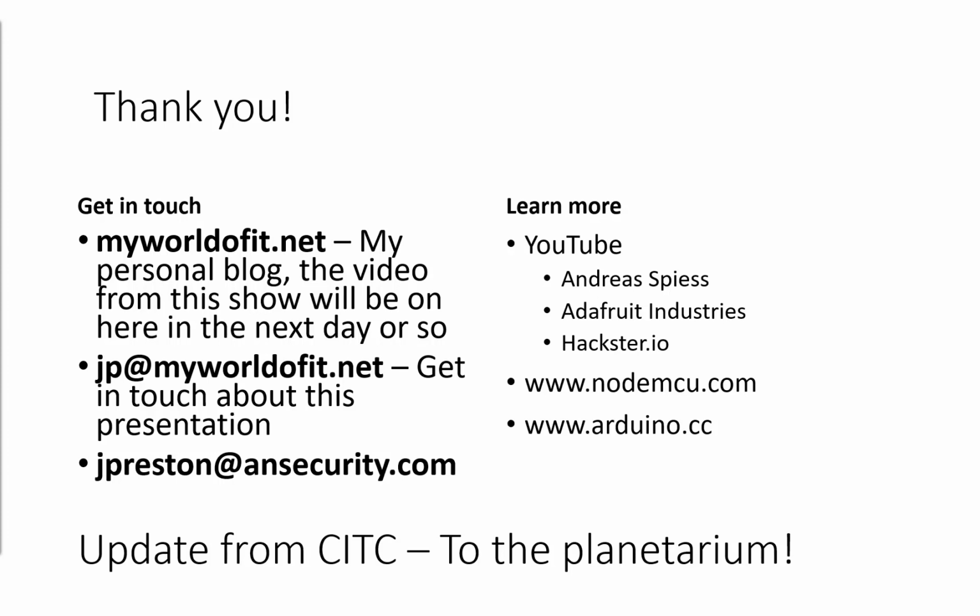Just the same technology that Amazon uses for the resale. Oh yeah, so the little Amazon tokens. So what I've effectively made here is one of those buttons at a much lower cost, so that when it runs out of battery power, I don't need to buy a new one. I should imagine so. Particularly for the NodeMCU Lua ones, you can actually set it up in a very similar fashion, whereby it hosts its own SSID. You connect to that SSID, you then give it the username and password for your pre-shared key network. It embeds that, and as long as it can talk to that network, it won't broadcast its own SSID again. So there are some very powerful things that are just baked straight in there, like the functionality you get out of the Amazon buttons.